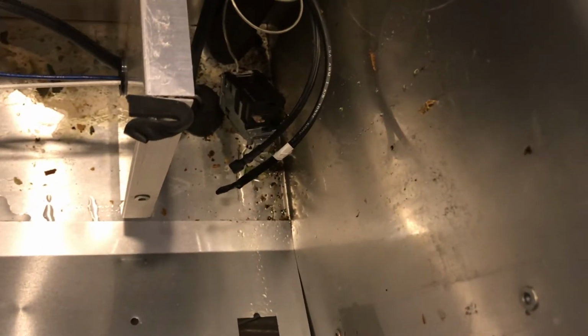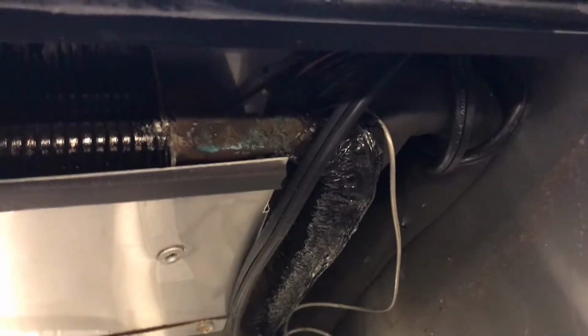And now we can go ahead and attach our new thermostat to our system after we have taken out the old one. So now I'm going to take out the old one. This can be very tricky to do, because I don't know if you guys can see, but there's a small little pipe that this sensor goes into. It's kind of hard to see, but it's right behind this pipe right here. So you want to push it all the way out. And here's your old thermostat.